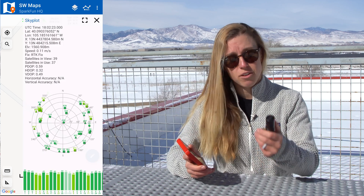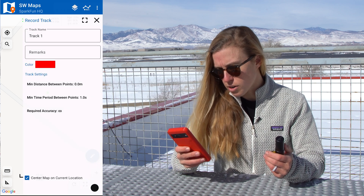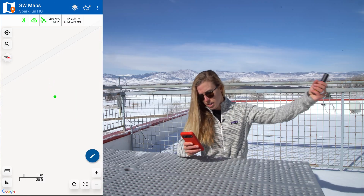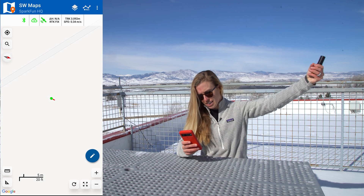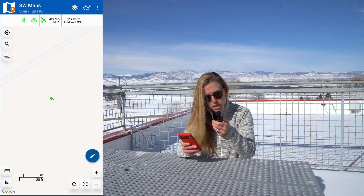What makes this unit comparable to our other high-precision GNSS units is that it has the opportunity to use RTK fix. When the postcard is not in RTK fix mode, you're going to get about one to two meters of accuracy. But once you get it into fix mode, you're going to have closer to about an inch of accuracy. Right now we're at 0.026, so practically an inch. On here, we have an RTK fix — it turns your dot from a red dot to a little green dot. If I hit record track and just move it back and forth on the screen, it will capture that accuracy all the way down to 0.026, which is very, very accurate.